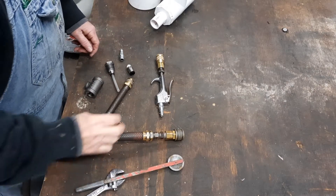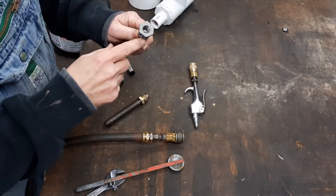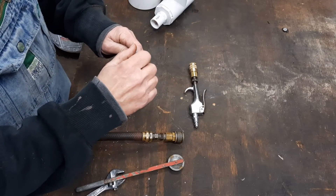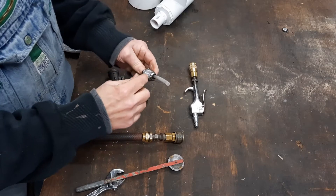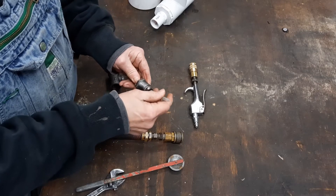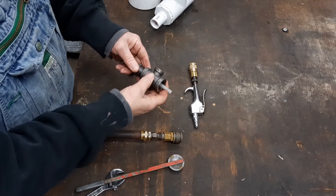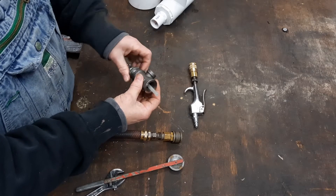Got a pipe fitting — it's a half by a quarter. Quarter pipe would screw in right there. I'm going to use that to put my air nipple in there, hook my air hose to. On the other side, I run a quarter-inch tap down in here and put one of those little leftover fittings I had. Measured me off a short piece of tubing. That piece of tubing is going to go through a T — it's a half by a quarter-inch black pipe T.